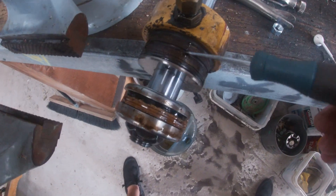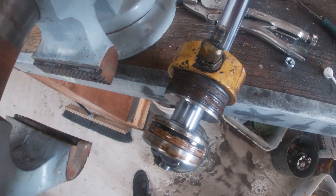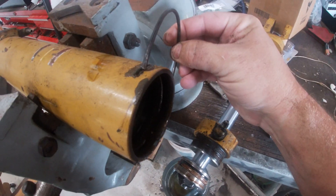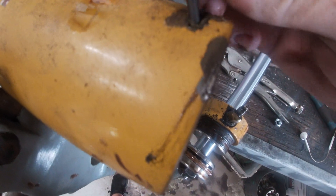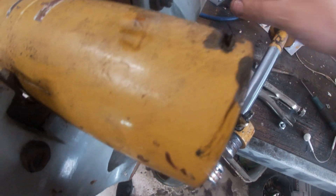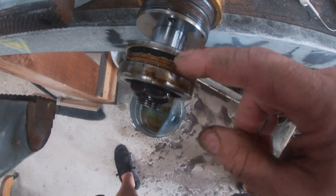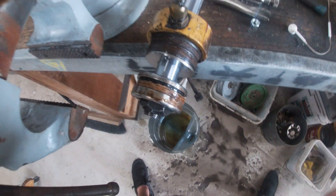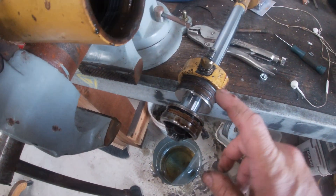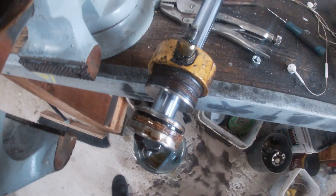This is all rust. This is the groove that the pin slides in - that's what locks the cylinder in. Typically you can turn this collar when the pin's in here, curls around inside the cylinder, and you can get a hold of it and pull and the pin comes out. I had to wedge it out with pliers. There's an o-ring, a flat face seal, a packing, your pressure seal, and probably another flat face seal at the top. I'm going to check Vermeer's website and look on eBay or the hydraulic shop to match it up.